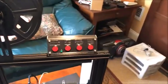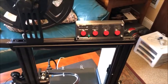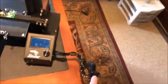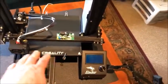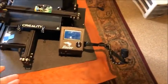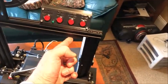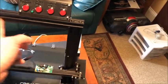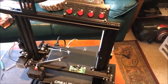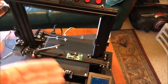You can control these remotely through the eWeLink app, or I have them show up in my Home Assistant. I have a page set up in Home Assistant that allows me to control these switches, see the camera, see the temperatures of the bed and tool — information sent by the OctoPi server. I can also switch to the OctoPi web page for more controls on temperature. From there I can turn on these lights through the GPIO pin. For the most part, once I set it off to print and leave the room, I use the Home Assistant screen to monitor the printer.